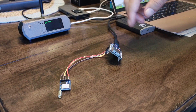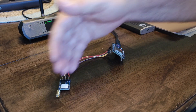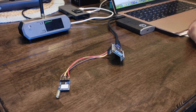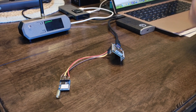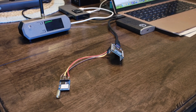All of that's possible — many networks, many nodes per network — you can see how this scales to huge amounts. That's what I'd call raw LoRa communication between two nodes, which is the fundamental technology that Meshtastic and similar platforms are built on. These SX1262-type LoRa chips communicate and are then connected via SPI to a computer — that's really what a Heltec V3 is: an ESP32 with Meshtastic software using this radio. You can apply this to an IoT network, reading sensors miles away and getting data to a central point.